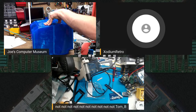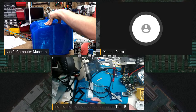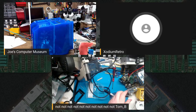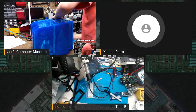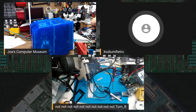I know what happened when I tried to assemble my RAM kit. I was talking to Drake about it, and he said you might want to put some solder on the fingers of the module because the PCBs are a little thin. I tried that, and it didn't want to fit my SE or my SE/30. So I wicked it all back up, and then it actually fit and worked. And I was like, okay, then.